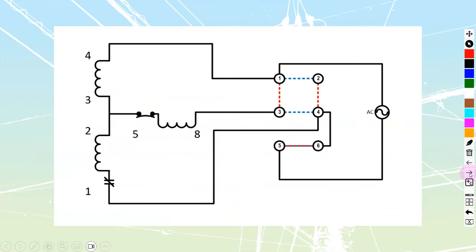Moving on to the next one — the three wire control method. This is fantastic because it means only 3 conductors are needed between my drum switch and my actual motor, which is a far cheaper cable. The guts of this one are that terminals 2, 3, and 5 are all connected together inside the motor. Based on where the drum switch is put, it basically swings the connection so current goes from 5 to 8 in forward, or from 8 to 5 for motor reversal.